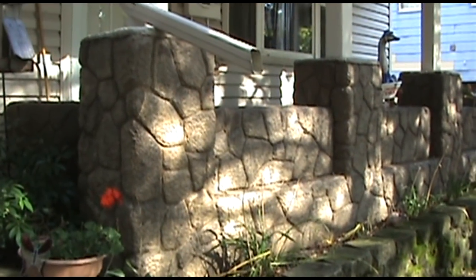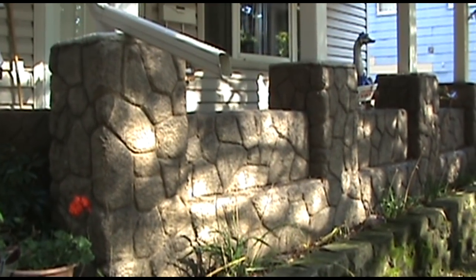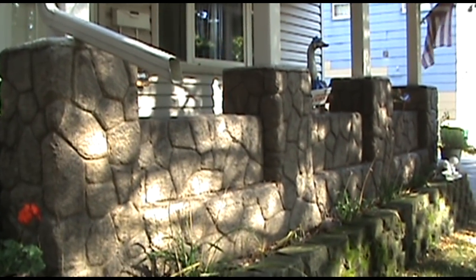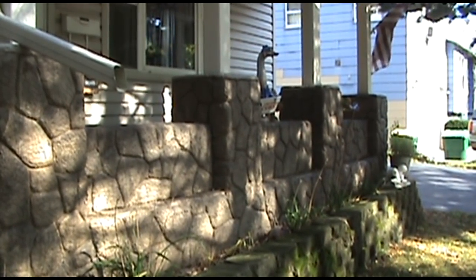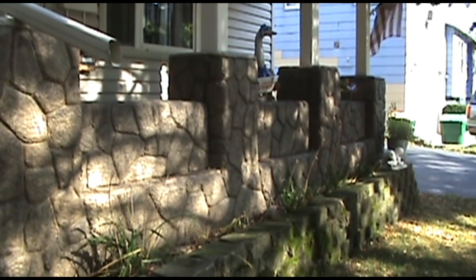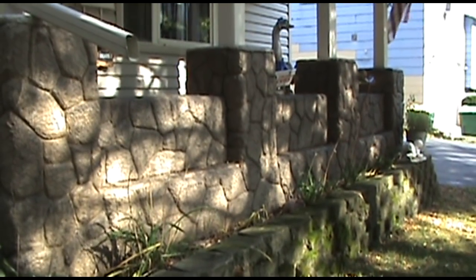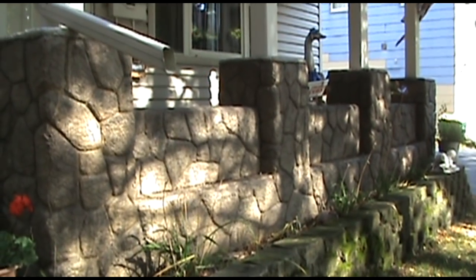This was done by building a wood frame, putting up concrete backer board, then covering it with expanded metal lath, and then finally scratch coating, and then finish coating, dividing it up into stone-shaped pieces, texturing with a sea sponge, staining with acid stain, and then sealing it. And we'll try to make our chain link fence reflect this construction.